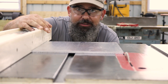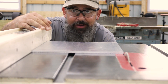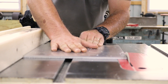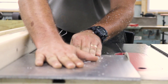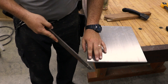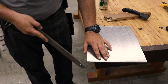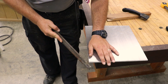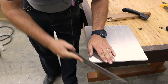By the way, this is a carbide tip blade, so it is perfectly acceptable to cut aluminum with it. It'll dull your blade a little bit faster than wood will, but aside from that it's fine. So the first thing we've got to do is ease these corners a little bit. I'm going to ease all four, because we don't want them gouging into our channels. They don't have to be completely rounded over — they just need to be eased a little bit so there's not such a sharp edge.